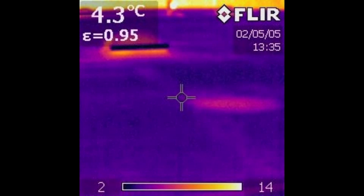Here is an infrared photo of the roof surface at night. You can see in the upper left-hand corner there's a skylight — they get heat loss at night. But if you come down into the middle of the picture off to the right, there's a blob of heat loss, and what that is is a roof leak — wet insulation underneath the surface of the roof. You can see the dark area around it; that's dry insulation because it releases its heat faster than the wet insulation does. So late at night we pick up the traces of the hot wet insulation. We use fluorescent spray paint, spray around that blob, and then when we're doing the repair or resurface project we cut out those areas and fill them with dry insulation.